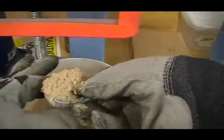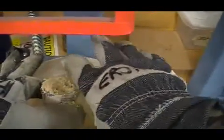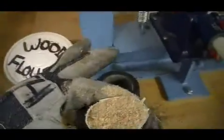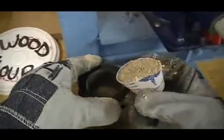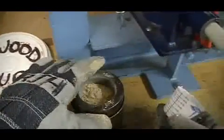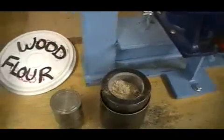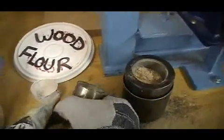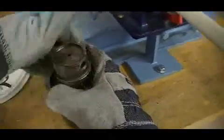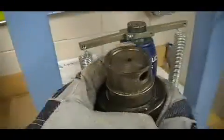and you'll be placing it into a hot compression mold tooling. Again, this came from the oven, so it's about 350 degrees, very, very hot. Pour the contents in the mold. You're going to place it on top of the jack screw on the hydraulic press. We'll insert the plunger. Again, I'll be helping you with this process. We'll get it in place.